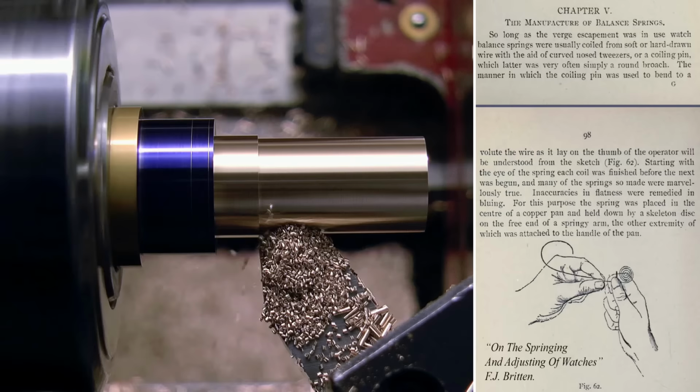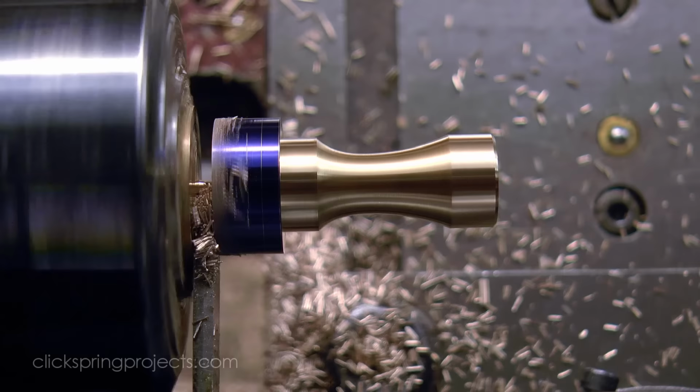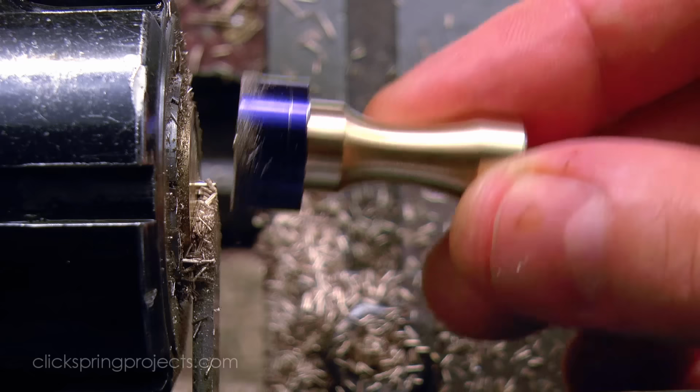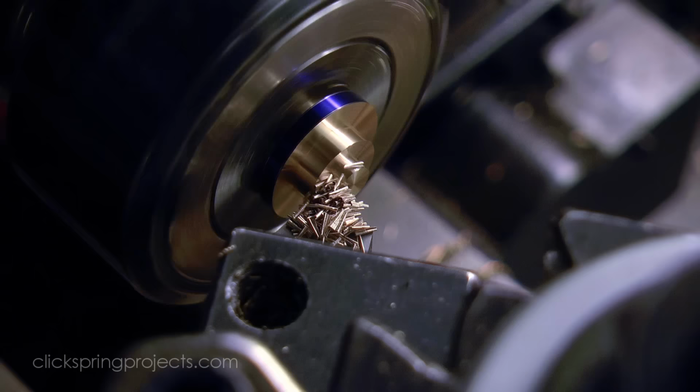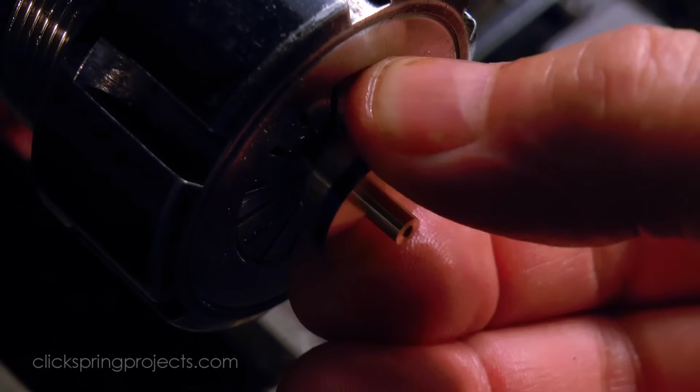A more modern approach is to use an alloy with specific temperature properties that simplifies the temperature compensation for a mechanical watch. The process to form the spring is much the same as what I'm about to go through, but there's a heat treating process for the alloy that tends to be more complex than we're usually able to reproduce in a home shop. And of course, the most recent generation of hairspring technology is a step jump entirely, using an etched silicon process. The predecessor to these modern developments that dominated mechanical watchmaking for a long time was the carbon steel hairspring paired with a bimetallic split balance wheel. And it's the formation of this type of hairspring that I'll investigate in this video.